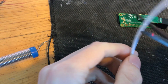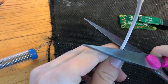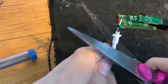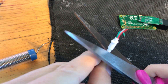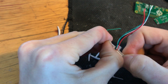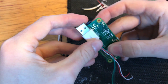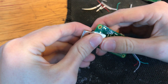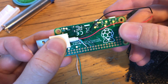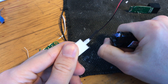Now that the ethernet side of things is sorted out, I'm going to turn my attention to how I'm actually going to power the device. The idea is there's going to be a male USB port on the bottom of the Pi, and then you could just plug the Pi straight into a computer, into a power socket, or whatever it might be. I thought I'd probably just use the plug that came with the adapter — I'm going to cut that up and strip it and then connect it up. I'm probably going to hot glue it to the Pi on the end here. But firstly, I need to deal with those green and white wires — I've cut them and I'm going to put some heat shrink tubing over the top just to make sure they don't touch anything they shouldn't.